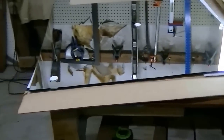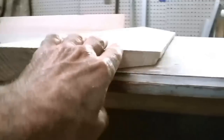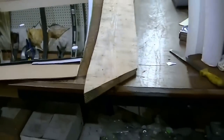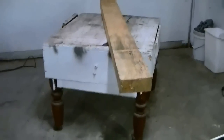The first thing I want to do is get my measurement of the mirror. I want to do about a 7-inch wide frame around it and have one side thicker than the other. You can't do this on a table saw — you just don't have a big enough blade — so we're going to cut them out of this cant and get over to the sawmill and cut it at an angle.